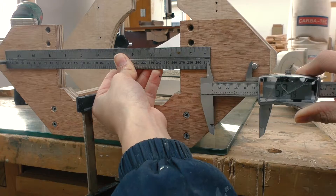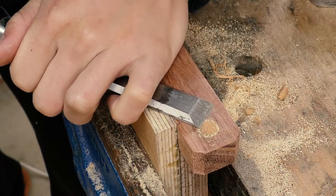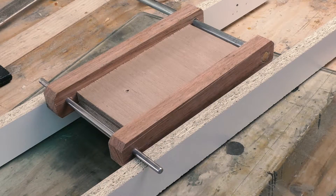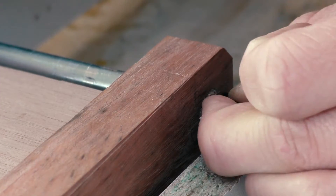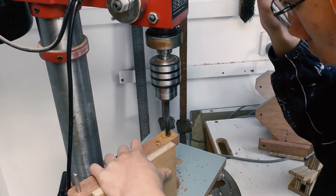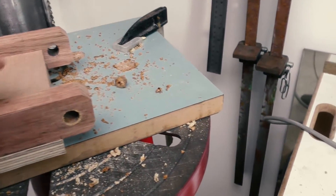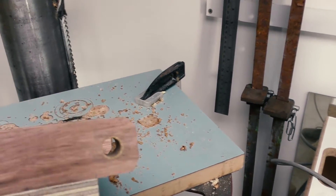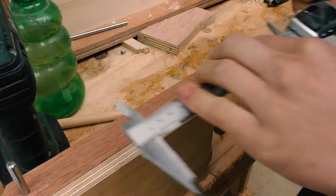For the round amount I can't really see any twist, and it seems to have the right distance apart. By now the glue on the dowels has dried and I can trim them almost flush on a bandsaw, then finish it off with my chisels. To ensure the new hole is in plane with the rest of the holes, I've placed it on three points and now I'll just mark it out with a 10 mil dowel marker. That was an epic fail — I should have waited much longer for the glue to dry because it just pops right off. Alright, it's the next day. Let's try it out again.